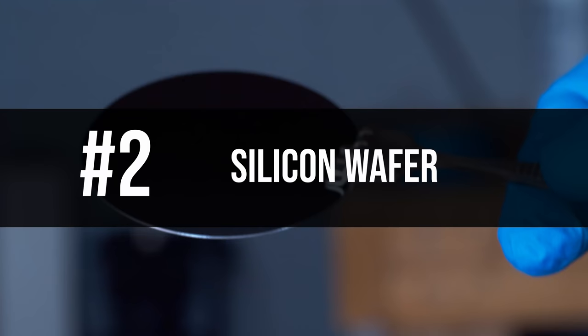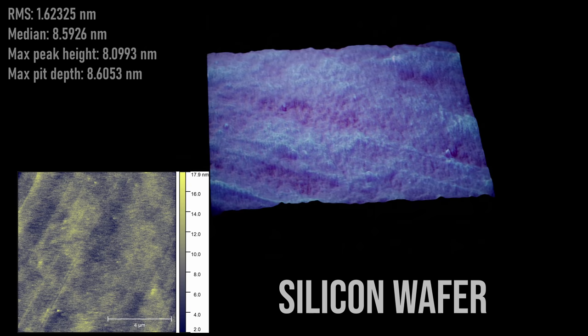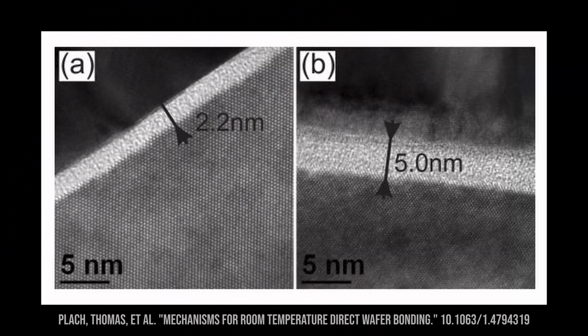The second flattest item I have around the shop is this silicon wafer. It is single side polished on one side and it's basically a mirror. RMS roughness is 1.6 nanometers, so this is a pretty smooth piece of material. Silicon is actually a pretty interesting material because it natively forms a very thin oxide layer — a layer of glass essentially on top of the silicon. So when you scan just the wafer like I did, it has at least several nanometers of silicon dioxide on top. The silicon dioxide is pretty smooth like we've seen with the glass samples so far, but it's not super crystallinely smooth, just the way the glass forms on top.